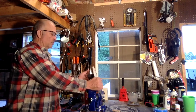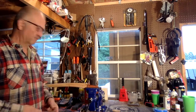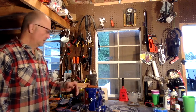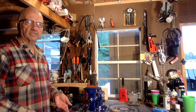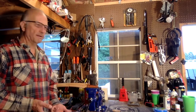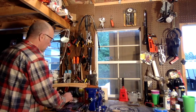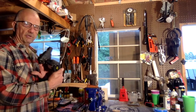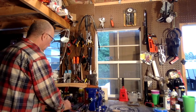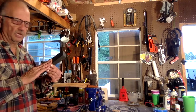Pulling into yourself, you may accidentally bring your hand or your knuckles right over the edge, which would definitely not feel good. For sharpening the axes or machetes, which also has a flat style double bevel edge, you could use any of the tools we've talked about before. My favorite is the little belt sander — it takes short work of this, we'd be done in about two seconds. You could also use the regular abrasive two-sided abrasive stone, and you need to use oil.